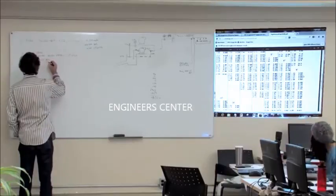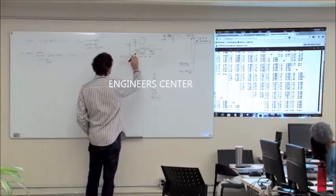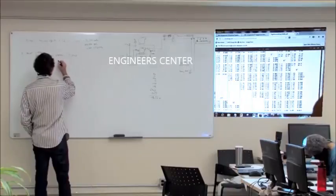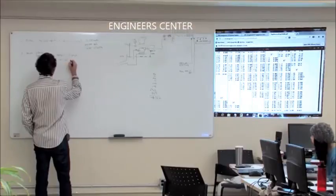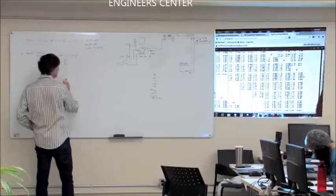psi per 100 feet times what we think we're going to have in line losses here, or the number of feet. So let's say we have 10 feet. We're going to multiply that by 4 for elbows and things like that, so 40 feet. So a correction for elbows, a multiplier for elbows, maybe is a better way to say that.